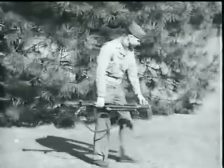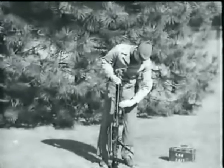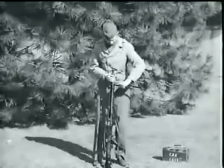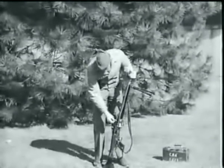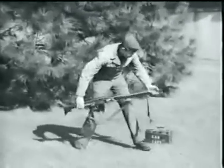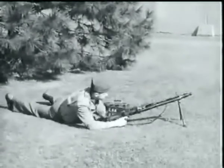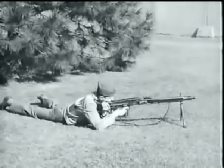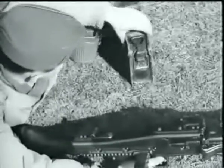The latest German machine gun, and the one which is gradually replacing the MG 34, is the dual purpose caliber 7.92 millimeter MG 42. New production methods which employ pressings, riveting, and spot welding give it a less finished appearance than the MG 34 without affecting its efficiency. With the exception of the removal of the barrel, the procedure for firing and stripping this gun is very much the same as for the MG 34.